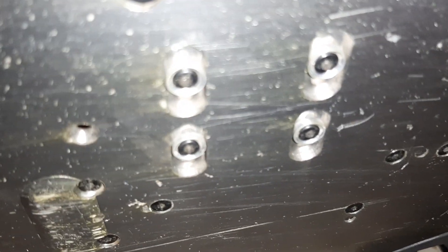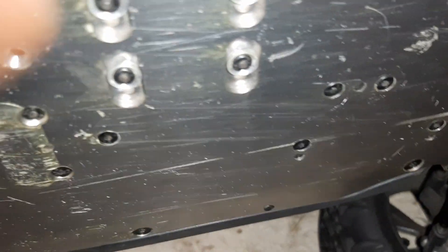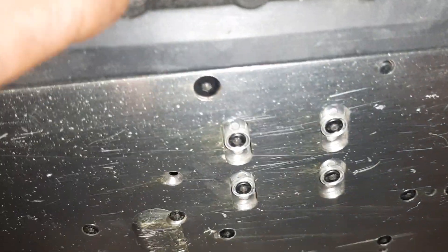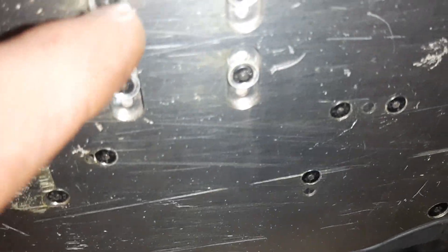On the bottom, I set my plate in place with the motor mounted, and I took a hammer and a punch, laid it down on this side and had somebody help me hold it. In the center of each slot, I put my mid-size pinion gear on — which is the 16-tooth one that's on now — and I drilled my holes in the center of those slots.